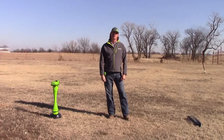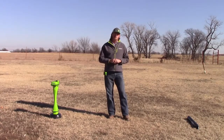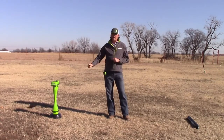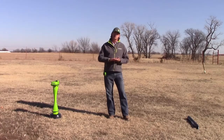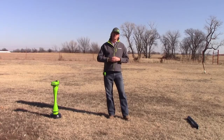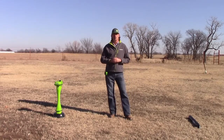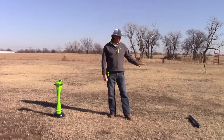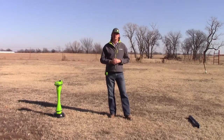The next thing I want to explain briefly is the two methods of calibration when using a TK series tracker. The first is what we call a connected calibration — that means we are connected from the tracker to one of our configurable beacons via Bluetooth, and we've set up that beacon in the tracker with the two frequencies we want to use downhole and the power output of that beacon. What's nice about connected calibration is the tracker will actually calibrate both frequencies for you during the calibration process, which is critical if you want access to both frequencies while drilling. The second method is an unconnected calibration — that's when you're calibrating the tracker to a non-configurable beacon, and you have to calibrate each frequency individually or manually.